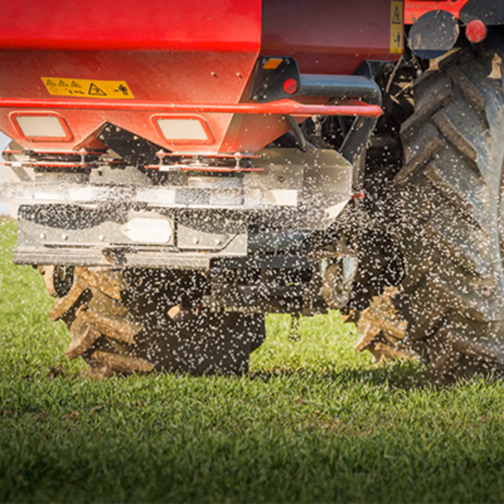Standing at the back of the tractor, make sure it's level across the back. Then from the side, get the spreader up to working height. There are good apps from most manufacturers that give you the working height, but typically you're talking about 60 to 70 centimeters over the crop. A lot of people don't think of that — they measure it in the yard, but when you go out in the field the grass is going to be higher, so you need to measure in the field. Once at the right height, check from the side that you're level front to back. It's simple enough but a lot of people aren't adhering to it.